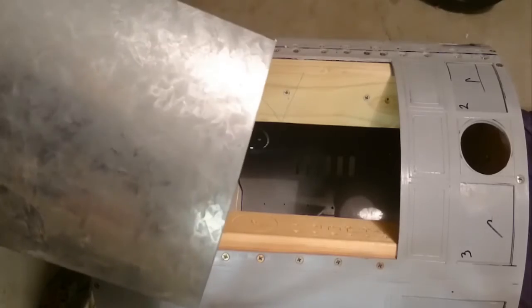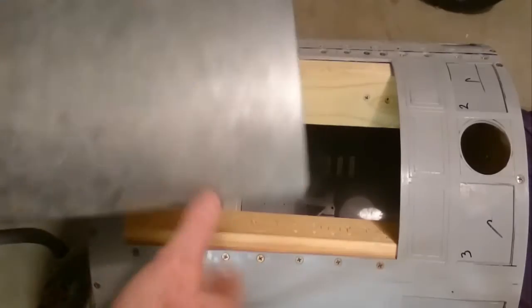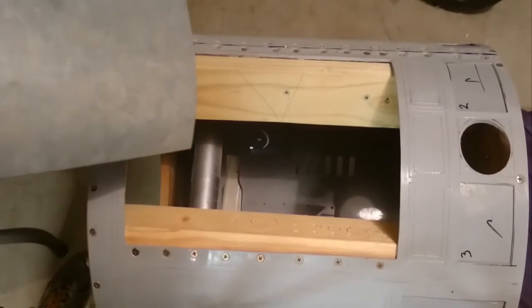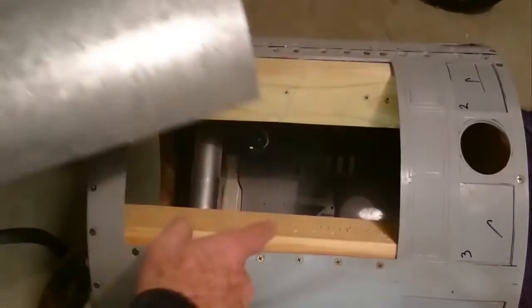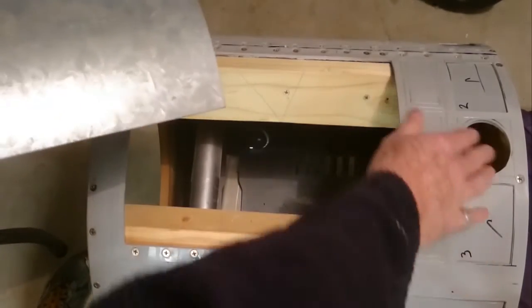As I mentioned previously, you've got to get a barrel rolled up. This is 1.6mm or 1.5mm steel, rolled to the full diameter of the barrel, which is 400mm. I've only got a piece about double this length — this part will be for the hatch and the offcut for other parts on the body that have to be around here.